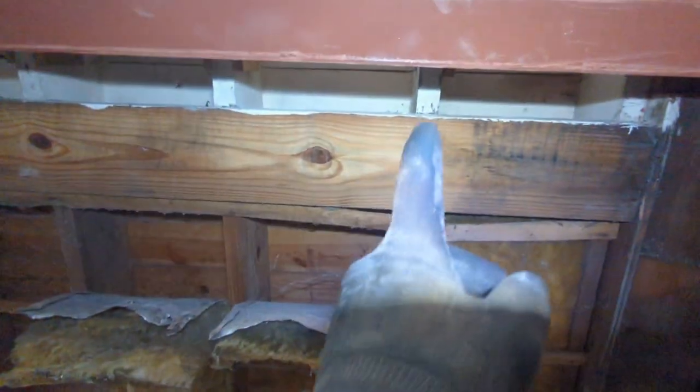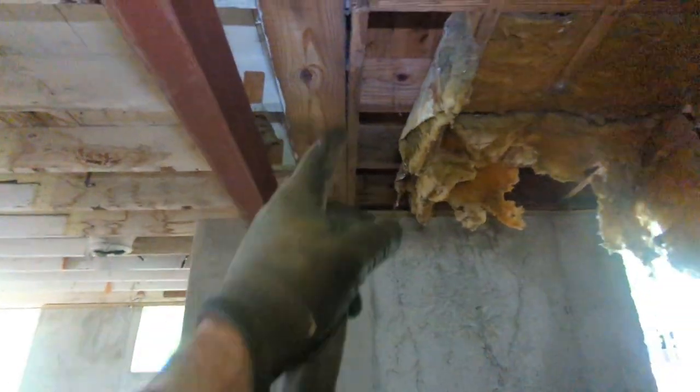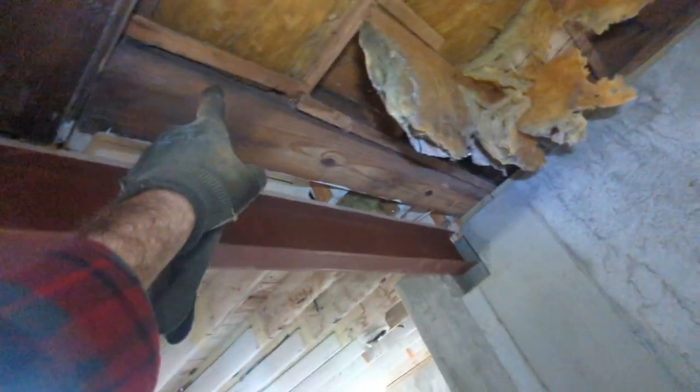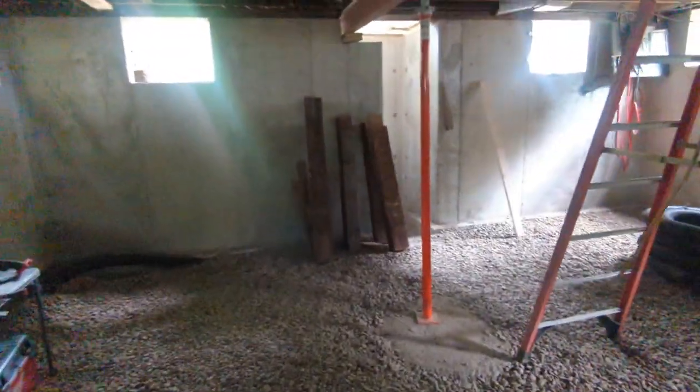Maybe these joists actually line up. I thought for a second there that could be all one full stick, but it's already 16 feet practically, so there's no way that's a 22-foot 2x8, I don't think. But we're going to get underneath there and poke around and see. Now see, there's blocking and stuff, so we've got to get some stuff down and out of our way and start amassing basically another load of crap for the dumpster or a dump trailer taken to the dump.